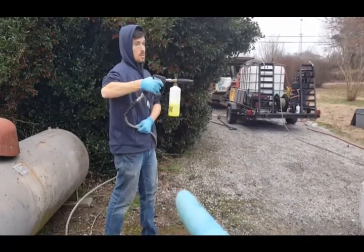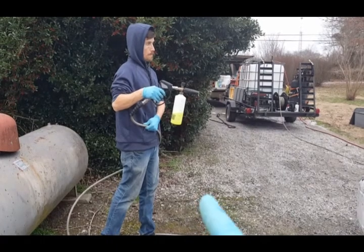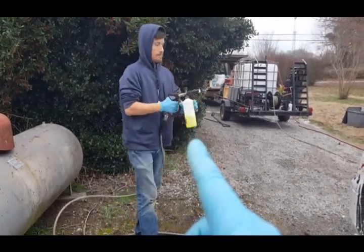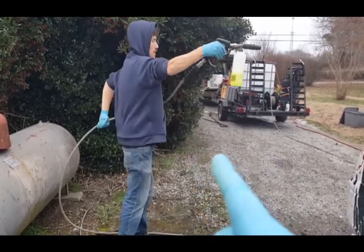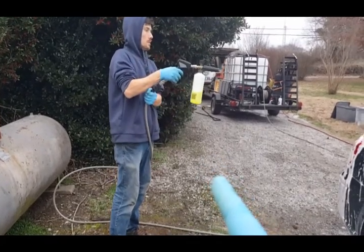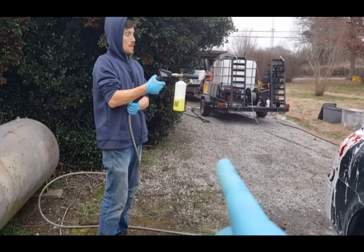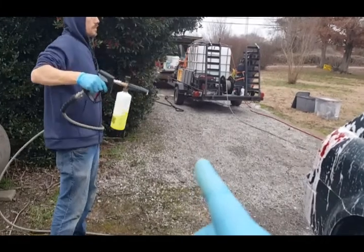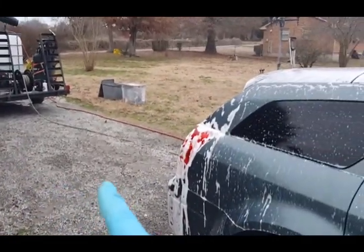The other video I made was with the Sunjo SPX 9004 that does 2 gallons a minute. And I changed out the orifice to a 1.1 so it would actually foam with the Sunjo, because with the 1.25 it wasn't really doing anything. But I'm just now using it with my gas pressure washer that's 2.5 gallons a minute and at 2800 working psi. But let's take a look at this foam it's producing.